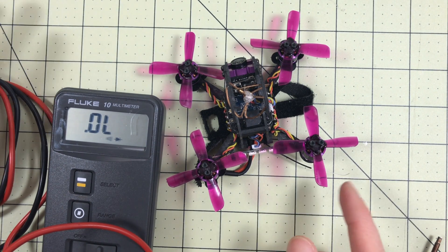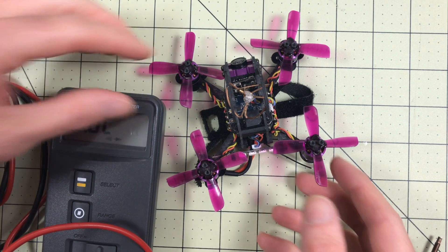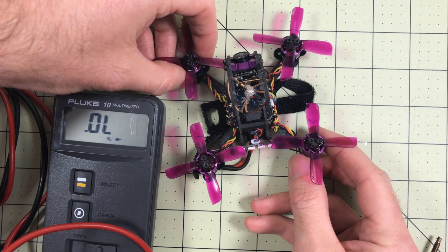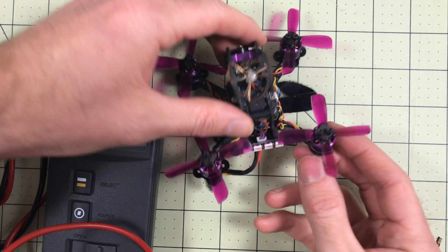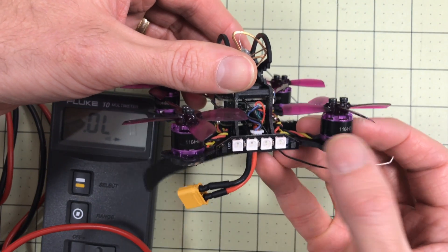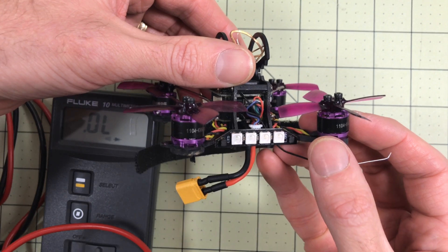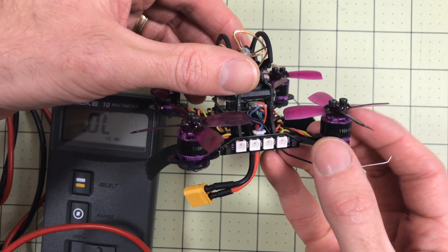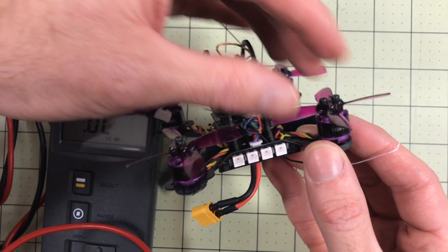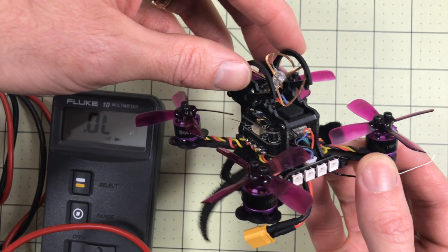Option one: you can email Banggood, because they are working out the issue. I'm trying to give them information and they'll be happy to fix it for you — they'd rather fix it with a new plate. They have a riser plate that will lift the motor up probably a millimeter or two, you screw it down tight and you'll be fine. That's not a problem — with my old quadcopters I had lots of adapter plates, and this just lifts things up a little bit.